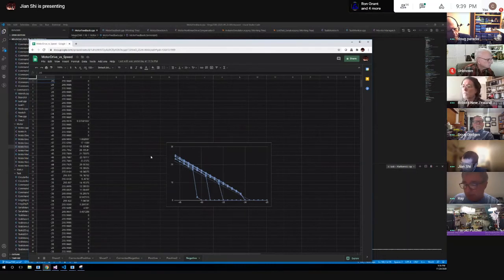On the Mega it is 490 hertz on some of the pins and 980 on other pins. It really just depends: pins 2 through 13 and 44 through 46 are 490 hertz, and 5 and 6 are actually 980 hertz. So it depends even which ones you call out. They don't tell you that, but yeah, they are different. That would be a good way for you to see if you get a change. I'll see what I can do with specifying the PWM frequency here.